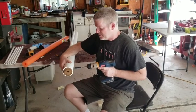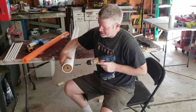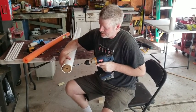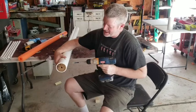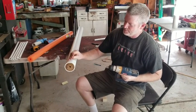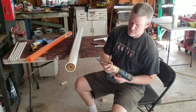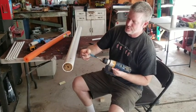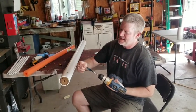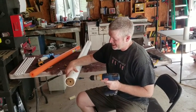I mean, you want to try not to go too far, but if you do, not the end of the world. So you take this, make sure it's on forward. Alright, so I'm backing this out right now because what happens sometimes is when you first start to drill, the plastic gets caught up in the teeth right there, and that keeps you from being able to go in the wood. So you just back it out. If the plastic actually gets caught in there, knock it out, then you go back in.